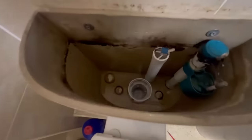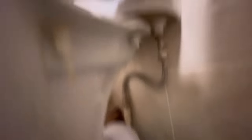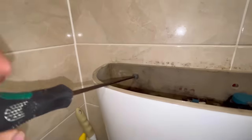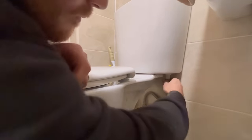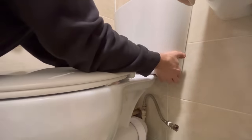We don't carry that exact one on the van. We do carry one of these — it's just a Fluidmaster one from Screwfix, actually quite good, comes with a three-year guarantee and they're reasonable on price. So we're just going to undo the nut that holds the cistern to the pan, push it up, and that'll start it draining down. You can use a wet vac if you want, but this is an easy way to drain it — just take the nut completely out. That'll drain into a tub. There are two screws that hold the cistern back to the wall, so we can undo them, then disconnect the inlet. Unlike the last one, there's no overflow — it's a built-in overflow on this one. Use a compression spanner to undo the inlet connection to the fill valve. Now it's ready to come off.